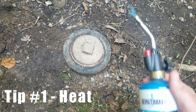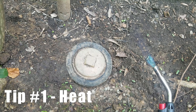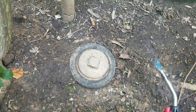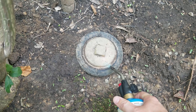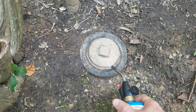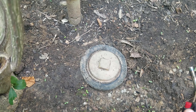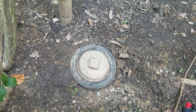The first tip we're going to use is heat — in this case a propane torch. I'm using this outdoors. If you're using this indoors, you want to be very careful. Use a heat shield if you've got any area of concern that you might hit with the torch. What we're going to do is heat this up just around the outside edge, right where the brass meets the cast iron, evenly around the outside edge. We're not going to get it white hot, but we'll continue to heat it up and then use our plumber's wrench to try to remove it.